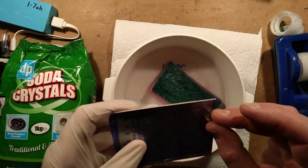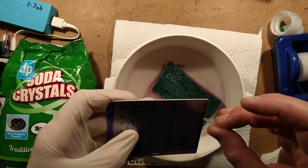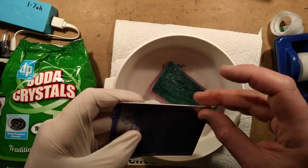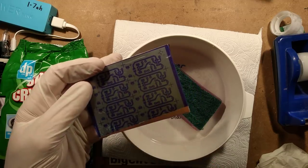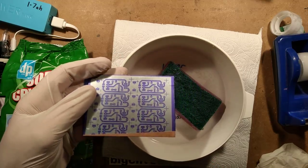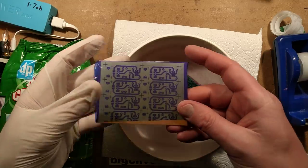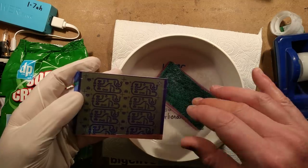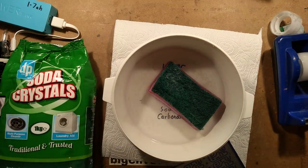Let's see if I can loosen the protective layer of film and get it to come off — there it goes. Because if you work with this stuff, there's a good chance at some point you're going to forget that plastic film is on there, and when you do, no matter how long you expose it for, it just won't develop. The developer is based around sodium carbonate — let's get a glove on here, hopefully not a leaky glove.